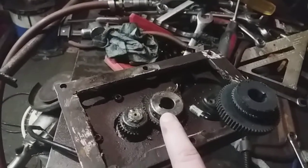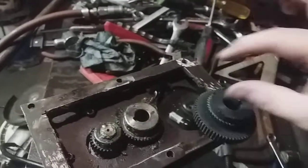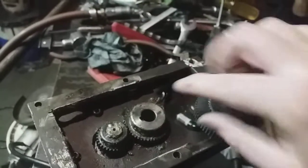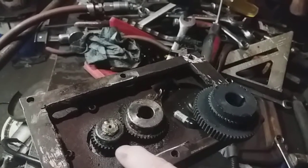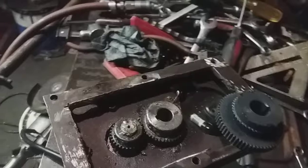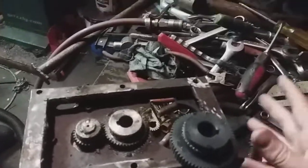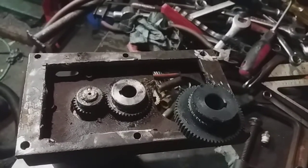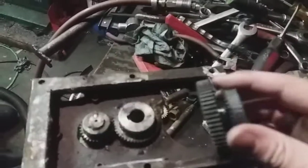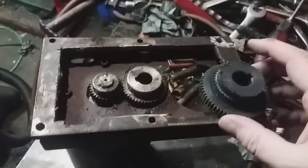But I've decided, like what he did there, to turn it faster. I got another set. This one here is like a 35 millimeter step across here. And the new set's going to be a 35 teeth gear. I can't even remember what I've got on these. I think this is like a 42 and a 30 or 35, something like that. It was a 1.5 ratio. Well, actually, I'm just going to do a 1-to-1. And honestly, when you're spinning up, you're not going to have low end torque with the motor, because if you put it on low range, or low speed on high, you can stall the thing out by grabbing the spindle, but not so much in low range. But this thing can't handle a whole lot of torque, as you can see, for that low range.